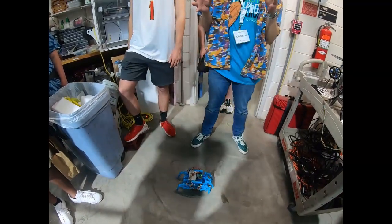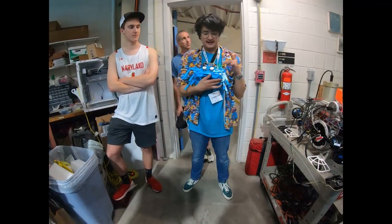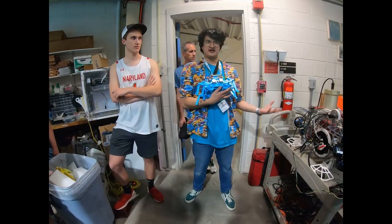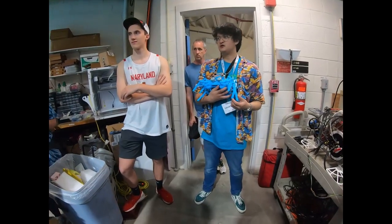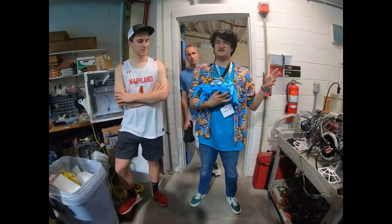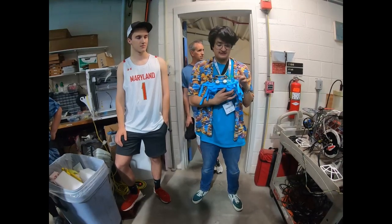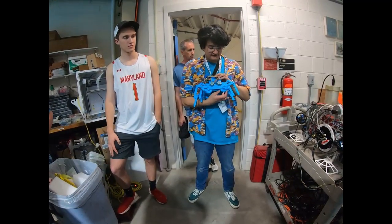But yeah, it basically takes all the coding problems that would go with using individual servos to control joints, and it makes it into a mechanical engineering problem. I got the inspiration, has anyone seen the kinetic sculptures called Strandbeests? They are really big walking mechanisms that use the air to essentially wind up and then push themselves forward, and they have legs that kind of go like that. And so I used a mechanism called a Klann mechanism that spins, that creates this kind of walking motion here.